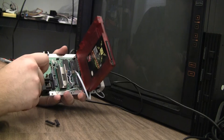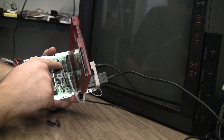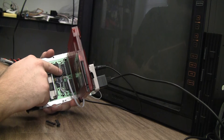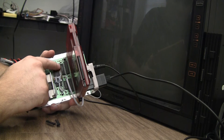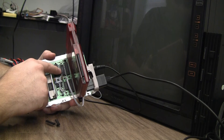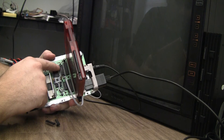The problem is sometimes the Power Pack doesn't work with the top loader. The problematic chip is the 373 chip right here. I've already taken this one out and soldered in some sockets so I can show you a few different chips. This is the original Motorola 74LS373N.